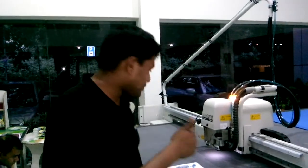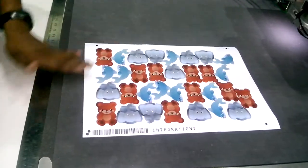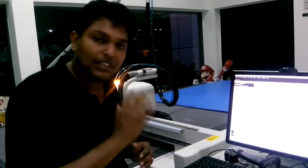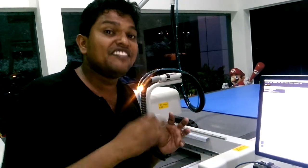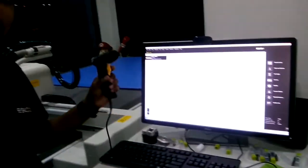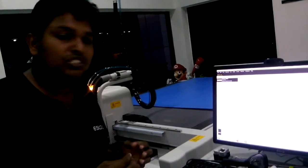So Prashant had exported the file — the PDF file — which went to the printer, and I got it printed along with the barcodes and the iCUT marks. On the system network, I had also downloaded the cut file which was sent by Prashant. Now the next thing is how much time does it take to open a job with the settings ready once you have the cut file. This is where I am going to use a barcode system along with the concept of cutting key to start the job in let's say 3 seconds, ready with all the settings.